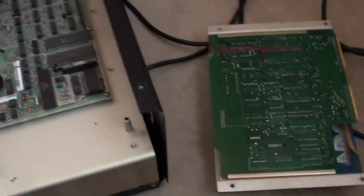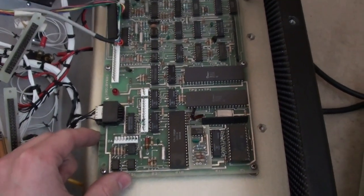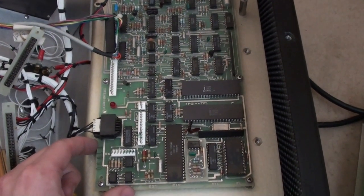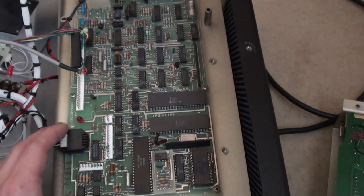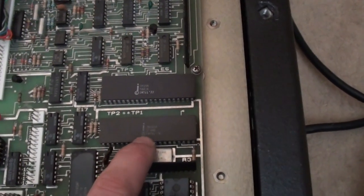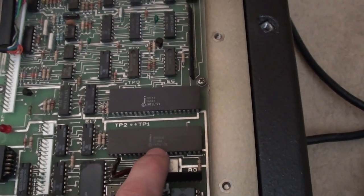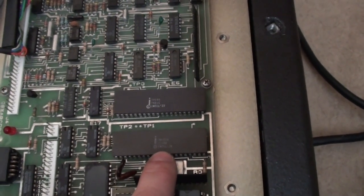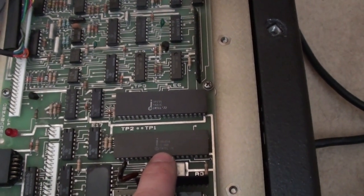Now that the card cage is off the main PCB, you can see this is the old tintype PCB — I haven't seen these for years, and usually when I do they're in old audio equipment, not old computer equipment like this. The main processor on this is an Intel 8085. I've tried to decipher the date code but, as anyone who knows about the 8085 will know, the date codes are difficult to decipher — you can only get them down to within about a year.